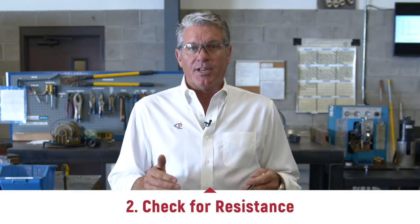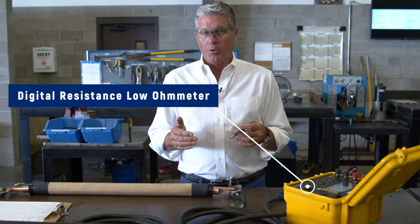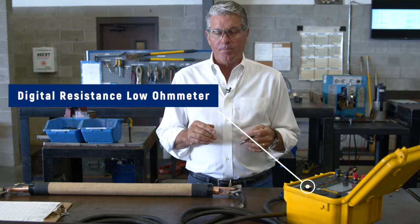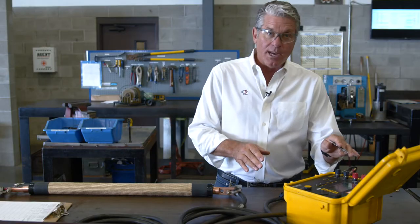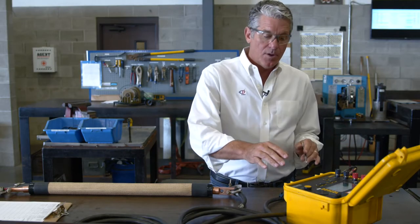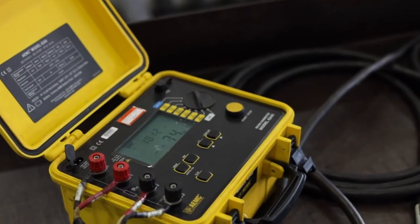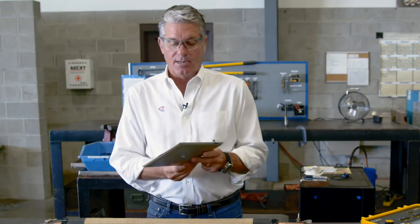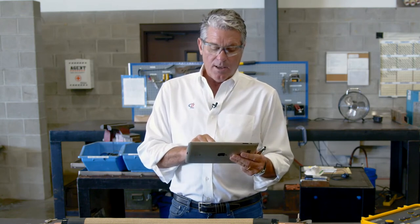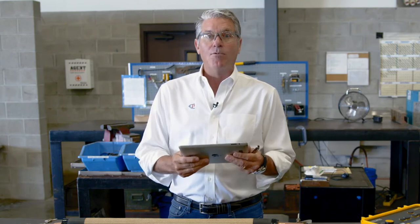Now that the mechanical and dimensional testing is completed, we'll check it for resistance. To check it for resistance, we have to use a DRLO — a digital resistance low ohm meter, which measures in one millionth of an ohm. To do this, we basically attach the two contact leads, calibrate the DRLO, and set it at 10 amps. We activate the device — it reads 74 micro ohms. We check to make sure that that is the designed rating. It's confirmed. We sign off on it for accountability and move on to the next test.